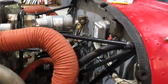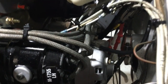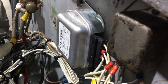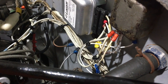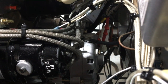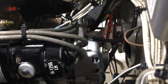Here's a nice little electrical problem for end of the week. We had a gear-driven alternator on the back of this Cessna and we've had an intermittent charging problem for some years. I notice other things have been replaced and the wiring was a mess. I spent a while going through the wiring — I'll show you some pictures of some chafes and shorts that were found. When we took the alternator off we found bits rattling around inside it, so we put a new alternator on.